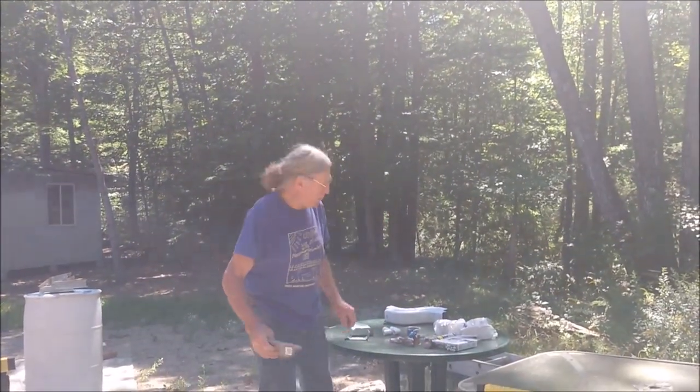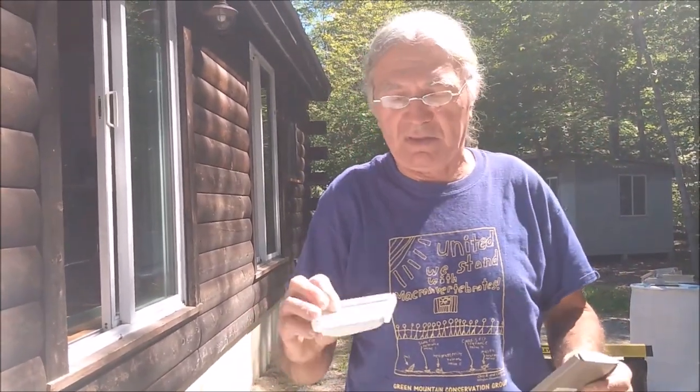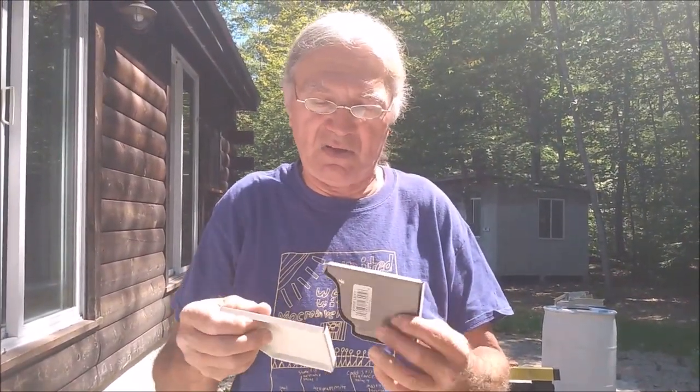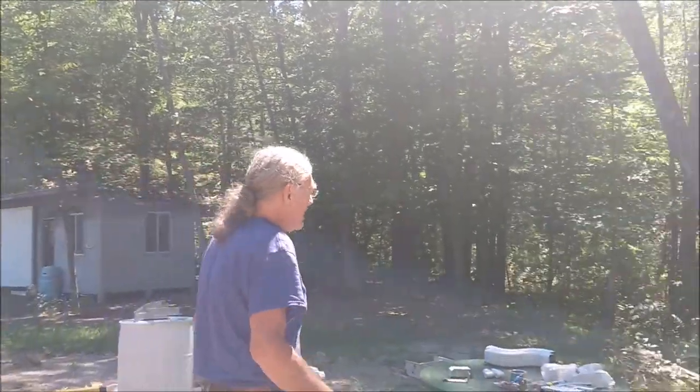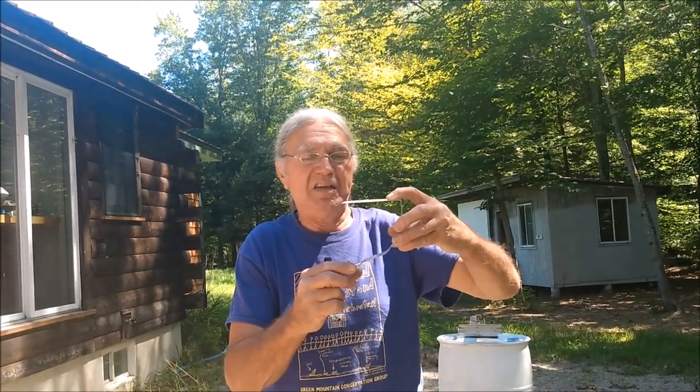Additionally, if you're buying new gutters, you'll get lengths. You have end caps, and these get put on with a specific adhesive that's made just for gutters, and that comes with the kit that you buy. Additionally, we have the joints that go between the sections of gutter. And these, again, will be done with adhesive.